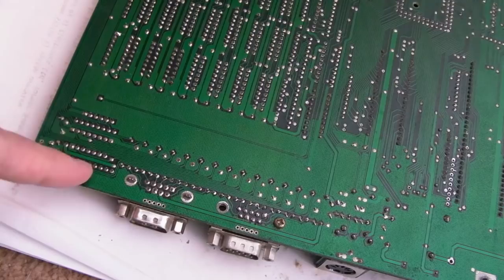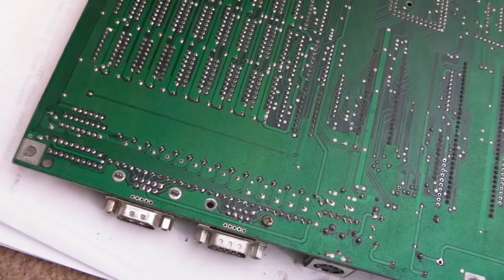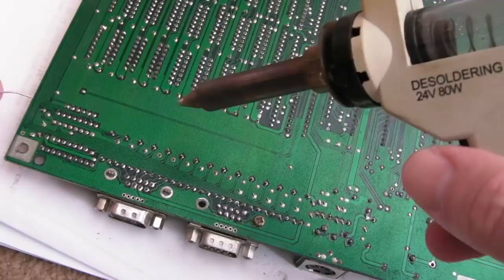The 157 might have bad connectivity to the resistor array, as well as some issues with the resistor array. It could be tin whiskers, a bit like we saw on that A500 Plus. I think that's what that problem was. We took off one of the little EMI components there, didn't we? I'll stick a link top right to that video. And yeah, it could be the same sort of issue, like tin whiskers, corrosion having spread and grown between the ground and the pin next to it, or something like that. I don't know.